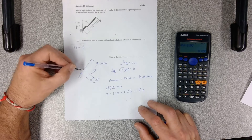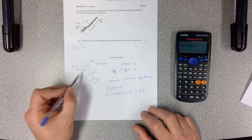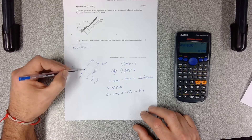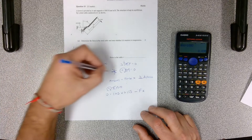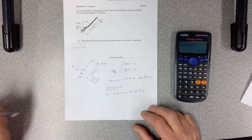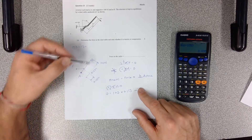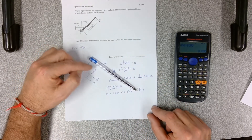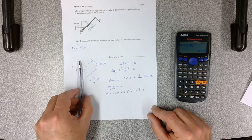You could be tempted to use the distance along the lever like we did for the 100 N force, but you would be wrong, because this cable force is not perpendicular to the lever. We need the perpendicular distance. We can use the idea of transmissibility of forces — we need to work out that perpendicular distance. Whenever we calculate a moment, we must use the perpendicular distance. The 100 N force makes a right angle with the lever, so that was perpendicular — but now we need another perpendicular distance.